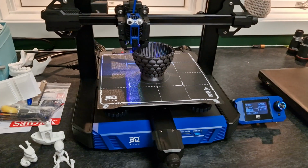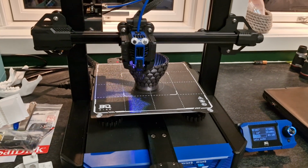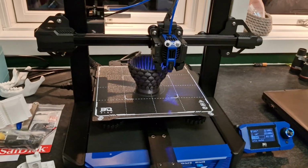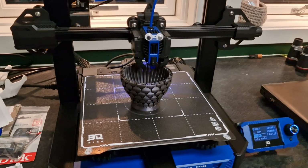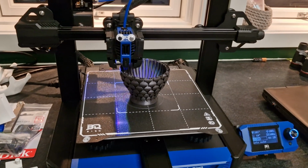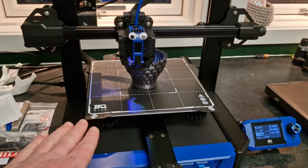They can go faster. I've had this so far up to 100 millimeters per second print speed. Actually, wall speed, not just print speed, where it was truly making that speed. And it does start showing its true colors when it does that. Anything above that, I'm not going to say it's worth it. If you're looking for printing extremely fast, you're going to want to build a true Core XY style printer. That's where the X and the Y are on one system and the bed doesn't move.